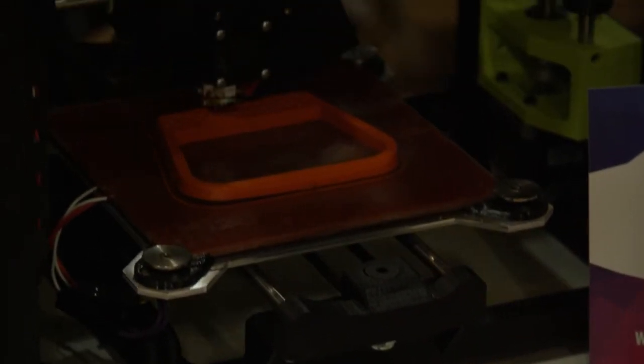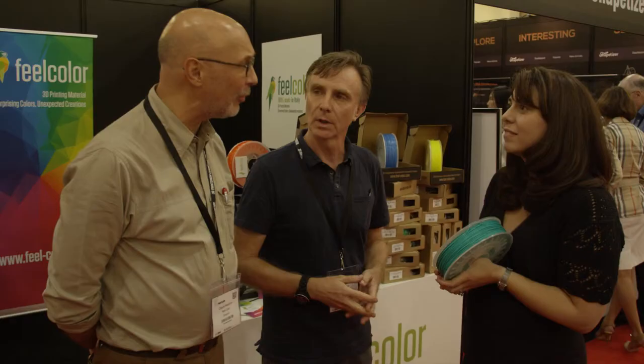We also have the 300-gram filament, so a smaller spool. And we have a microwave coloring technology that allows us to color even smaller quantities — even as little as 100 grams. That's great because you can really sample and get the color dialed in. A lot of times when you're custom color matching, you get a little swatch, but it's a square, not a filament — so when you go to print it, it's wrong. This way you can really dial it in and make sure you have the right color and a great match.